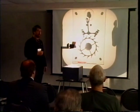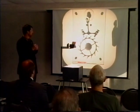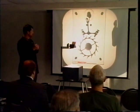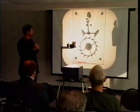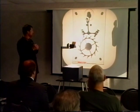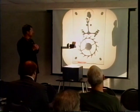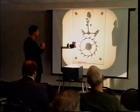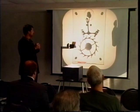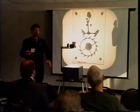So then they thought, we need to fix that so that the impulses are equal. And they came up with the equidistant escapement, which is what this one is, I believe. You can see the arm is quite a bit longer on the pallet fork, where the locking corner of the entrance jewel is equidistant from the pallet center as the locking corner of the exit stone. So when you draw an arc, it comes from here and goes through this here. So you have the same strength of impulse on both sides.